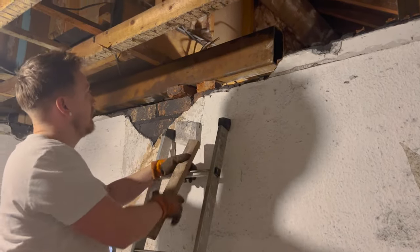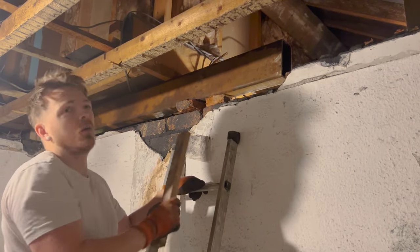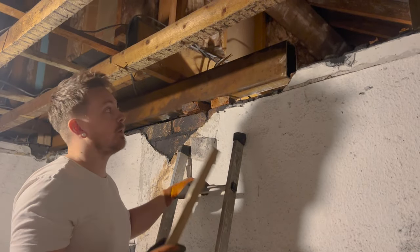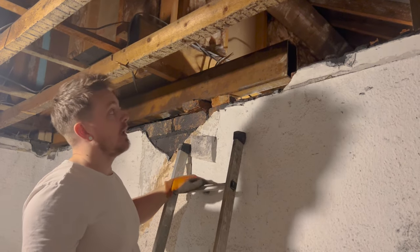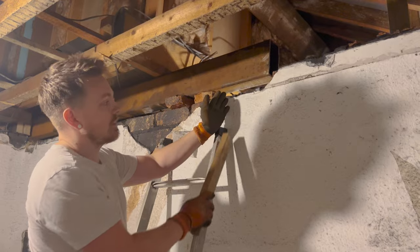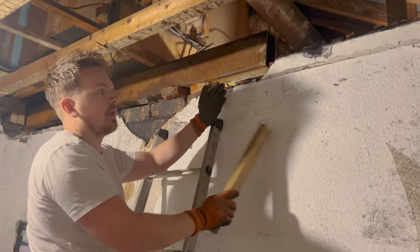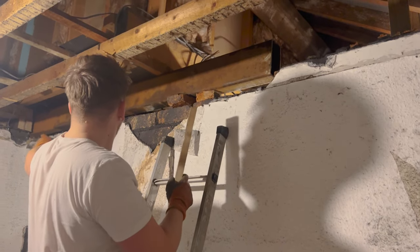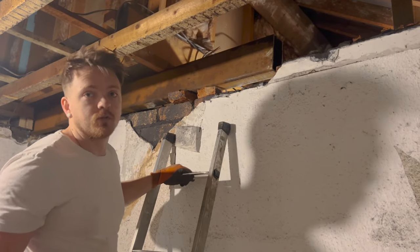The steel's in - I've packed it up here and put my laser on it. I've realised this end is about an inch lower, but when I check the ceiling it's all out of level anyway, so that doesn't matter. I'm just going to take my ceiling to the lowest point of the steel. What I need to do now is take this area out - I'm going to pick up some engineering bricks and make an engineering padstone just to take the end weight, as we're okay at the other end since it's sat on a wall going that way and it's not going to crumble.